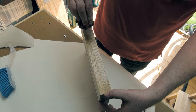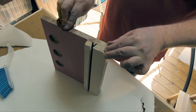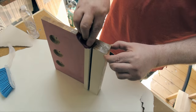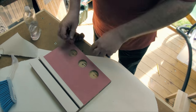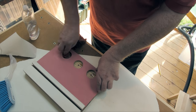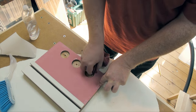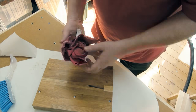Now this is my own clear oil and wax finish, which is a mix of mineral oil, mineral spirit, and about 10% paraffin wax, something I've used for years and may become a future video. Anyway, you apply it with a cloth and wipe away the excess. Applied to the Rustoleum, it gives a satin finish and just gives the chalk paint a little bit more protection.